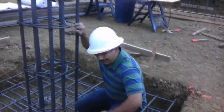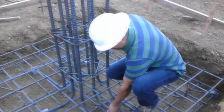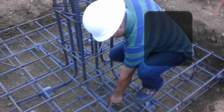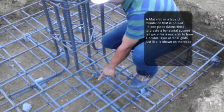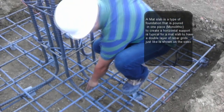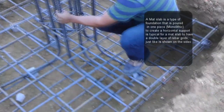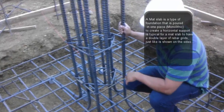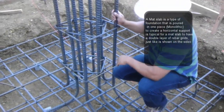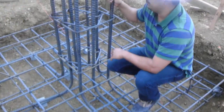So we're here at the column. What is the name of this stuff? This is the mat slab right now — it's a top and bottom layer. Between the two slabs it's set up on 12-inch centers, and there's rebar sitting in there at number 6. Then we have a number 8 for our upright, for our column support. And we're using our clips and our stirrups in there. This is a stabilizer to keep the bars in position and also to keep support of the bars in the boundaries of the pour.